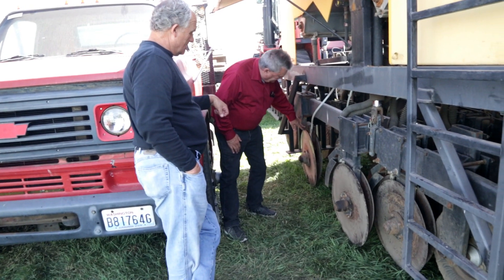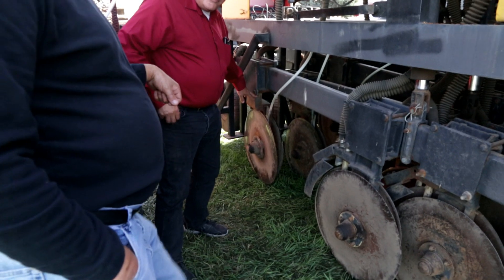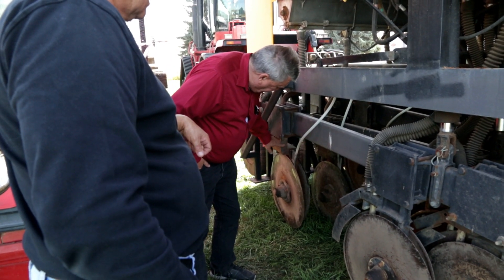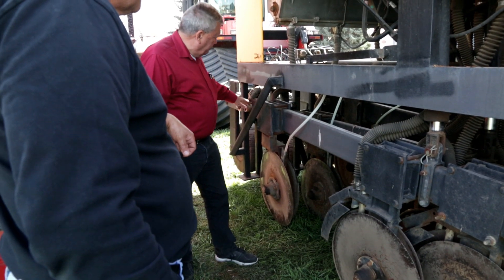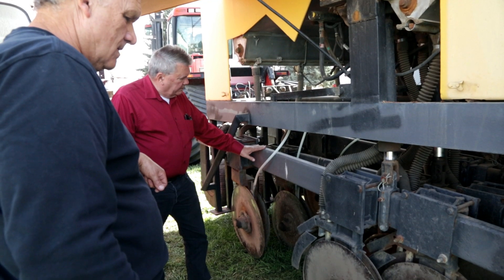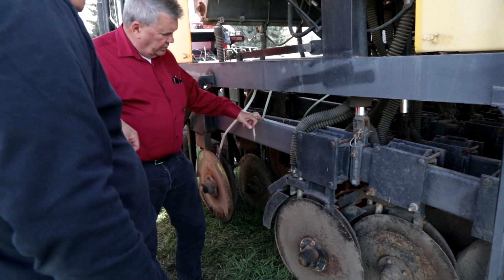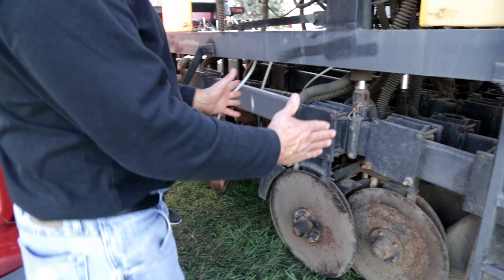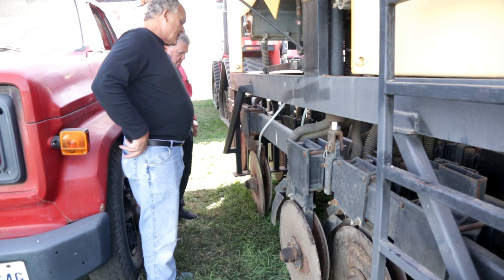Another cool part about this machine is the deep bander, which has a step opener — it steps over and goes exactly underneath the toolbar. That's made from 8630 steel, and there's such a tremendous load when you start turning on steep ground that you have to have this two-inch wide casting to handle the difficult loads. That's why you have your deep bander right out in front, so it's supported well by the toolbar. I moved everything back as far as I could intentionally to create a crawl space between the deep bander and the seed runs — you can crawl right through there on your hands without catching anything.